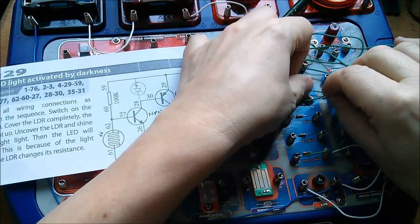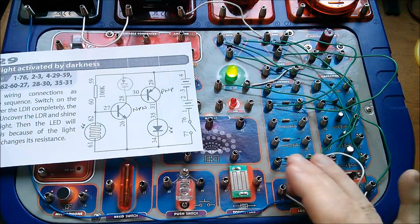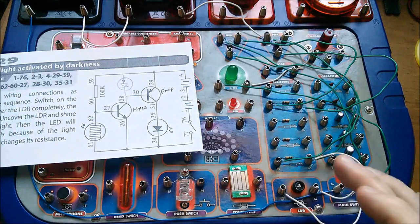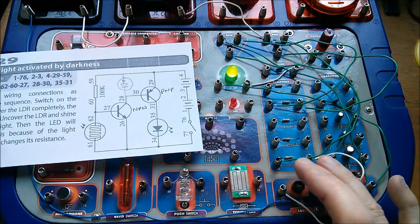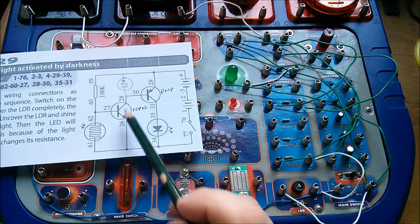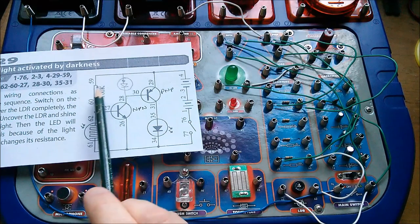So let's put that on there — that's still going to be enough protection for the circuit. Again that doesn't seem to have affected the gain terribly, it doesn't seem to have moved that dark point — the sun keeps coming in and out so that might be affecting things. Certainly a 1k in there protects these two transistors from an excessive current. With 100k here it's not going to happen, but if this were lowered...